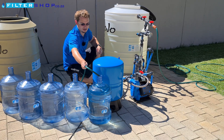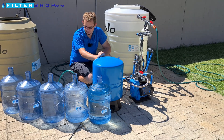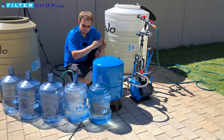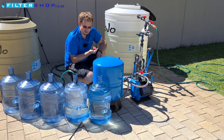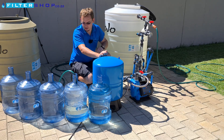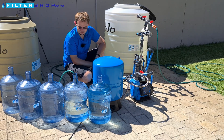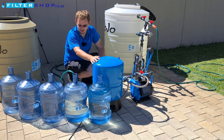The whole first test was done without the pump actually switching on. Our flow rate has dipped a bit because the tank is getting emptier, but when it reaches the threshold the pump will switch on and fill up the tank again. What we hope to see is the pump switches on, fills the tank, and then switches off again for quite a few cycles. The water is filling the tank at the moment as well.